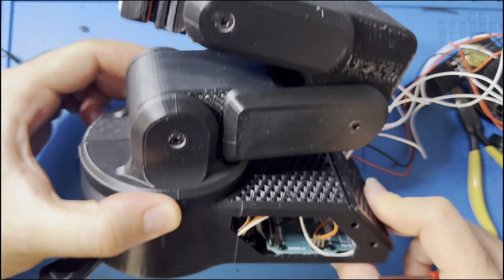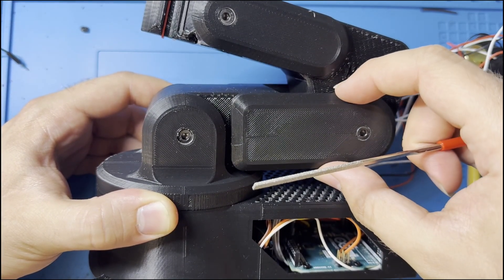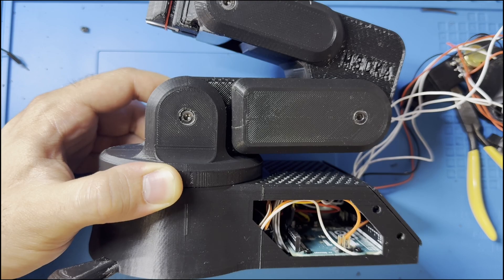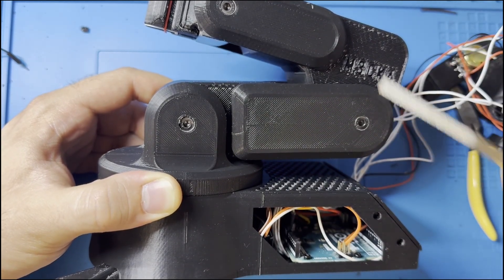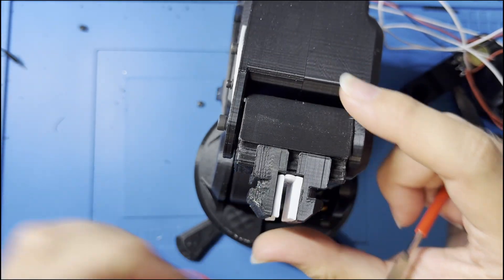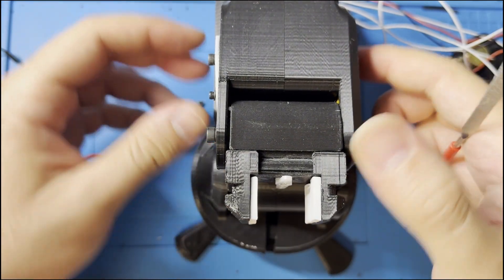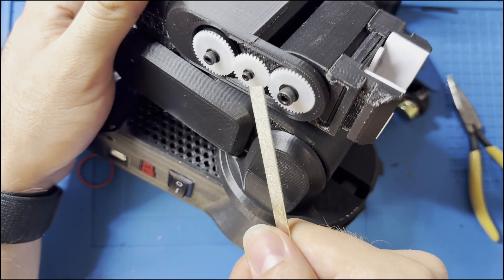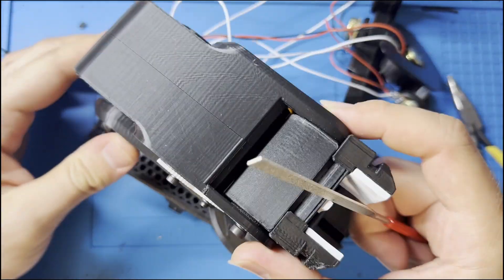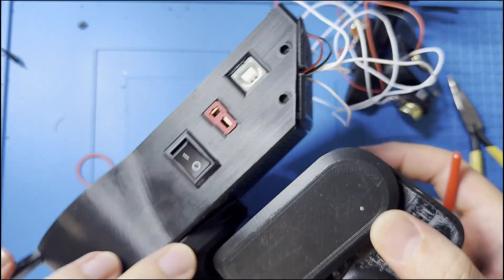Now that everything is done, we need to program the robot. But first, you need to unlock and release all the servo motors and set them to free position. When we program the servo motors, each one has a zero position — when we start it, it goes to zero position, and we don't know where that is. So we need to release them easily like this, and also this one. We may need to open the screw on this servo motor by removing this gear so these two would be free.